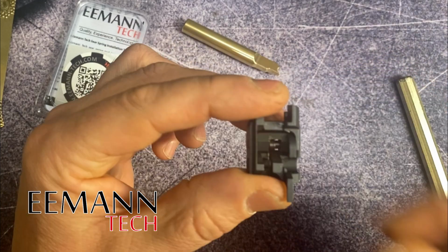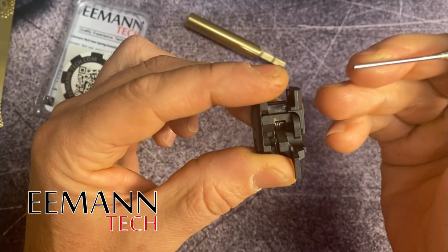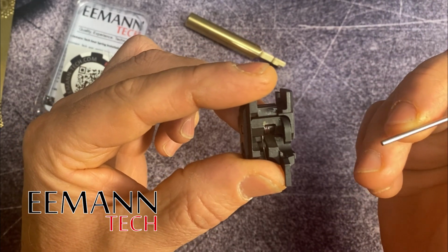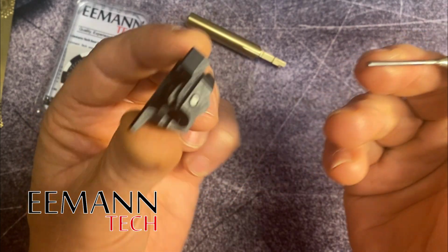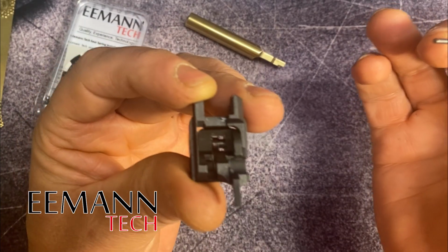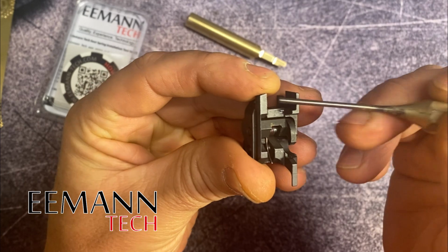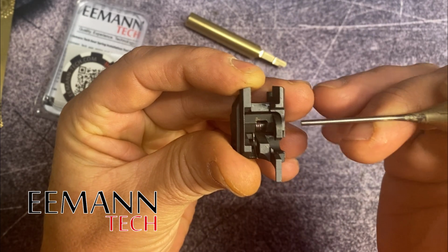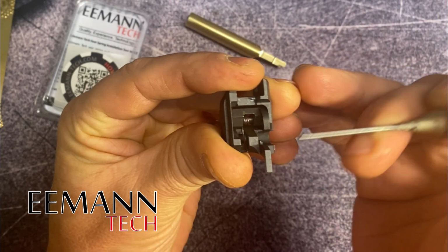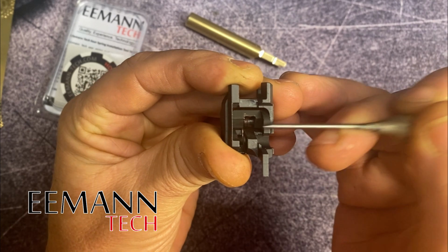well. Now when we start looking at replacing the spring or changing it out for whatever reason, all you need to do is remove it from your firearm, and we've got videos up there on how to do that already. Once the block is out, this is called an ejector block or a Sear spring housing, and it contains four parts really. It's the outer shell of the ejector block, it's the Sear itself, it's the Sear spring, and the ejector is built onto that, and the fourth part is the pin that holds it all together.